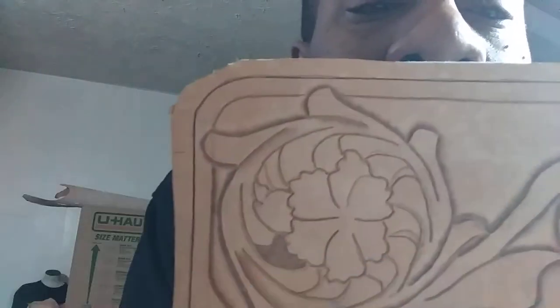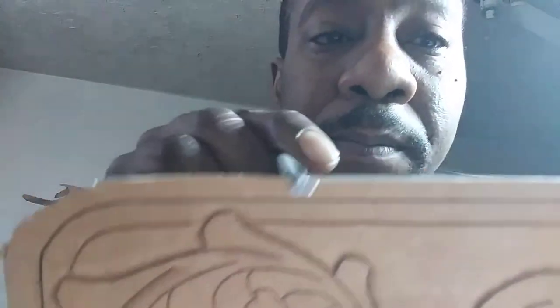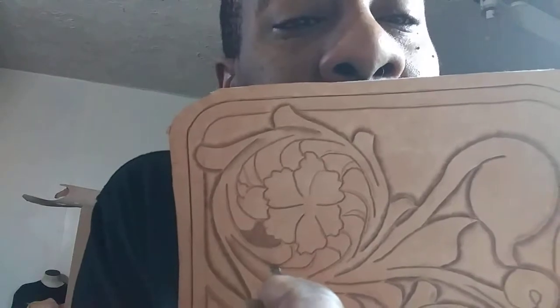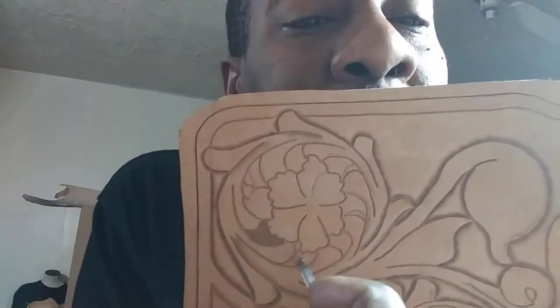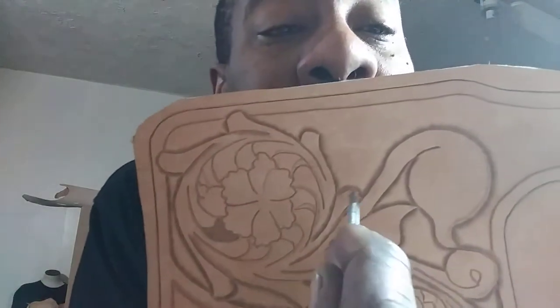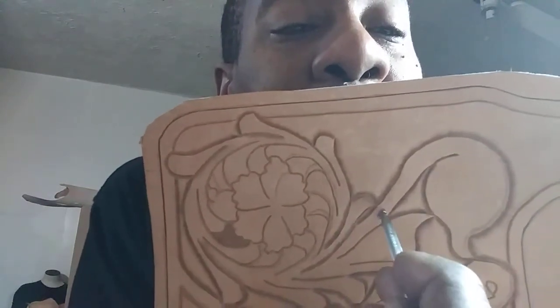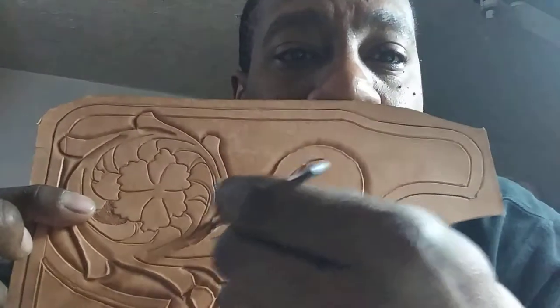A small backgrounder will fit and get down in there. I like the pear-shaped ones — they have a rounded end on the back and a pointed end on the top, so they can get up in between and right down into where it angles. That point lets you really get up in there to get your backgrounding in detail, working even in the small sections — not just around the leaves but right in the scrolls. You can even use a pointed backgrounder to get down into the points of your artwork.